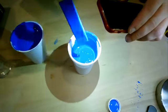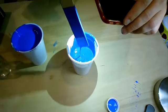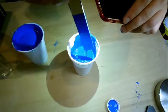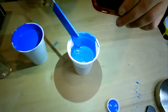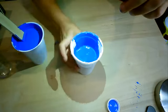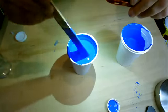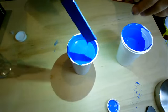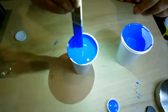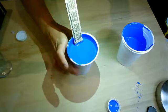If it's more than three or four seconds it's probably too thick for our sprayer. You're aiming for two to three seconds — if you're above four seconds it's a little too thick. This one straight out of the can, with no additives or thinning, is a little too thick. I have another cup here where we've added a thinner — you can see the difference. Stir it around, hold it up, and that trail goes away in about two to two-and-a-half seconds. That's pretty much ready to be sprayed. Make sure it's stirred really well so you're not getting sections of thicker and thinner, then pour it into the Preval sprayer.